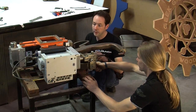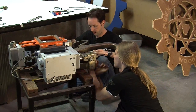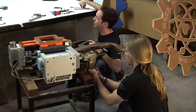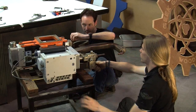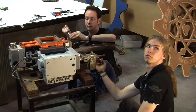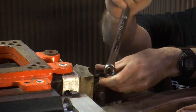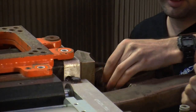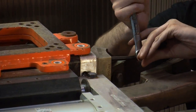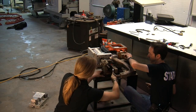All right, so you're working on those. I'm going to take off these up here with my woefully inadequate Allen wrench. It's like three sizes smaller than I need, but I'm going to use the open end wrench trick. Watch. You put that on there like that. You can zoom in on this. So you put that in there and then put an open end wrench on it, and you got to straighten it. And you can bump that right out, just like that. Ta-da! It's kind of unstable, but for breaking them free, it's a really good system.